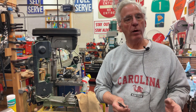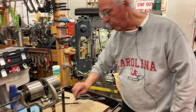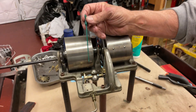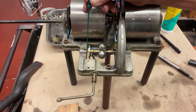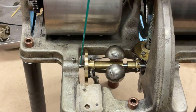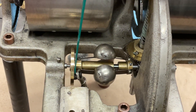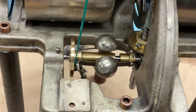I'm going to show you how to oil. We're going to start with sewing machine oil. I'm going to use my little Starbucks stopper, because that's always fun. So right here on this, I'm going to put a little dab at the end of the bearing right here, and then right there. We're going to put a little dab there. Now we're going to roll over and put a little dab of oil right here on the felt. This is the speed control mechanism.